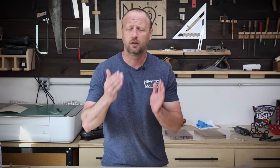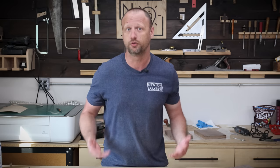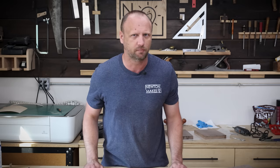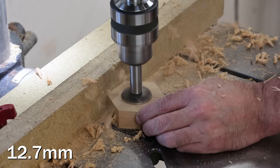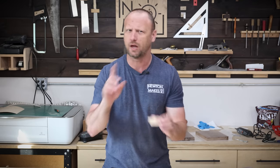You'll want to make these efficiently, safely, and repeatably, so I recommend making a dedicated jig based on the size of candle holders you want. DIY Montreal has a fantastic video on how she made a sled for this — definitely check that out. Mark the center point of your hexagon and, using a one-and-a-half-inch diameter Forstner bit, drill a hole about a half inch deep. This is the perfect size to hold a tea light candle purchased from Target.